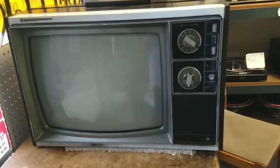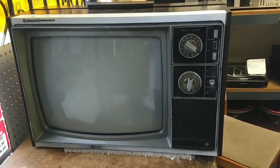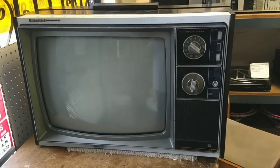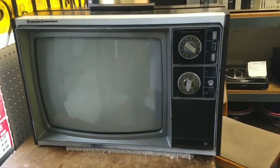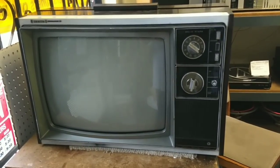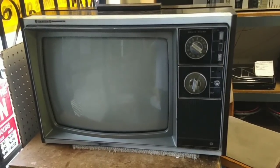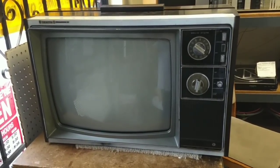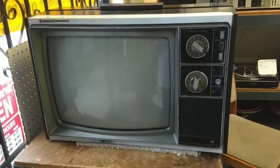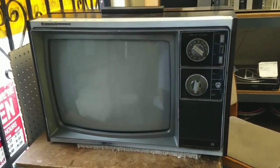As far as the blooming problem, both Radio TV Phono Nut and Tom pointed out to me that there were cross-references for the original tripler that turned out to be wrong, and I think the 528A should be the 526, as mentioned by Brian. However, Tom did me one better and found me a link to an NOS tripler kit from Zenith, which was supposed to be the updated part, which I've received. We're going to install that today and see if that works. Going back to the first video, when I did the initial power-on and test, the focus was crummy because the tripler focus divider network was bad, but there was no blooming. So the fact that I introduced the blooming problem tends to further support the problem with the replacement tripler, since the internal divider network of the 526 and the 528 are different.